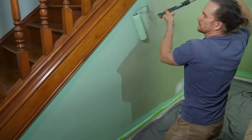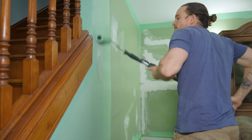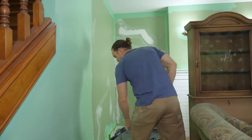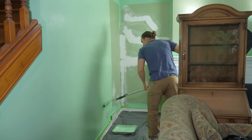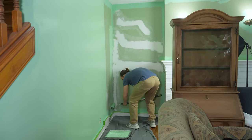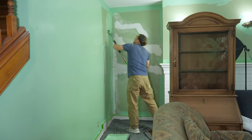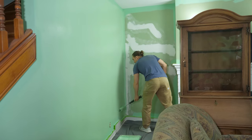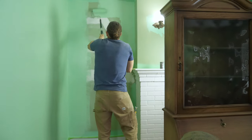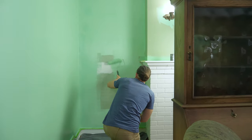I did roll in multiple directions under the stairs, but then went back and did up and down — certain areas call for a little adjustment. I like to roll right up next to the corners as close as possible to cover as much of the brush strokes as possible, so when done you really just have a thin quarter-to-half inch line of maybe some brush strokes around an outlet and along the ceiling. Brush strokes are just part of life — you can't paint without a brush.